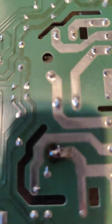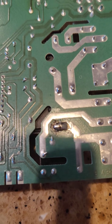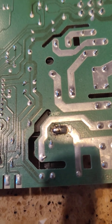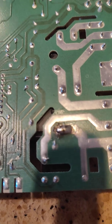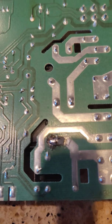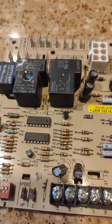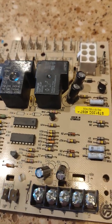Over time, I've had the same problem where we have a cold solder joint again — I've already fixed it. I probably should have videoed before I fixed it to show what a cold solder joint looks like, but it gets black around the cold solder joint and you can see that it's cracked. I have done this three times now on my system, so I actually have three boards. It wasn't until the third one that I realized I should just be re-soldering the cold solder joints, and I've been doing that since.